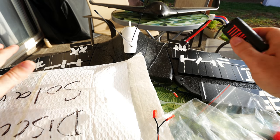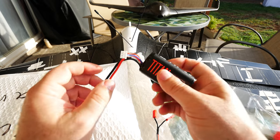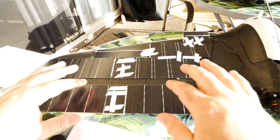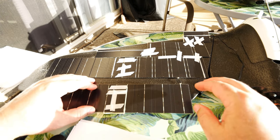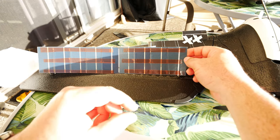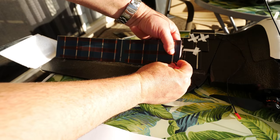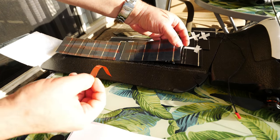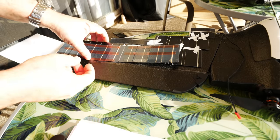The thing you don't want to do is have your battery topped off and leave it all connected sitting in the sun for a while, because there's no regulation — it counts on the plane drawing power in flight. You might want to cover the solar panels with some towels before you fly, otherwise you might overcharge your batteries. Before peeling the tape off, I want to position the panels and use this double-sided sticky tape — a really super low profile tape they pre-applied — and then stick them down.